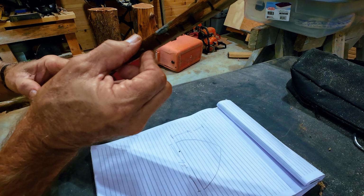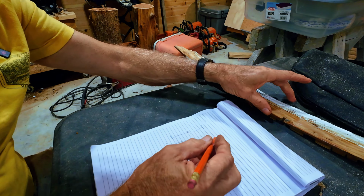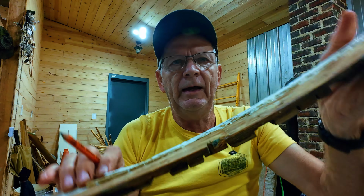This is approximately a half inch thick. So I need a piece of trim this wide and approximately this thick to go here and here. What I'm thinking, I'm gonna mill a piece of pine, straight grain pine, no knots or anything, this thick, maybe just a hair thicker, and then plane it down. And then I'm gonna go ahead and form it in a bow like this, okay? And let it dry in that shape.